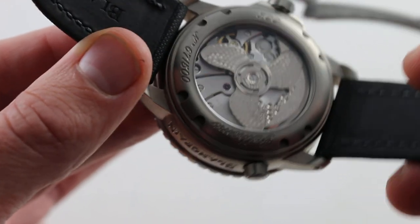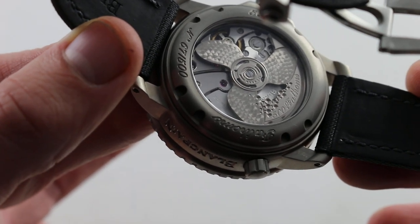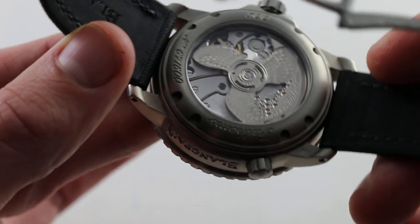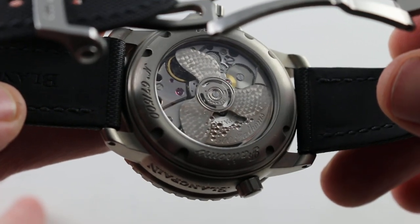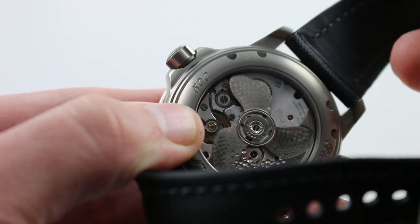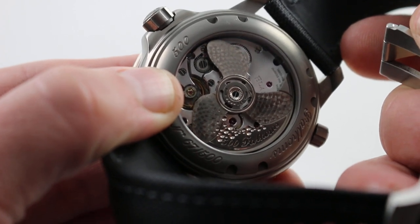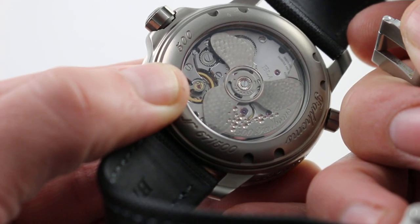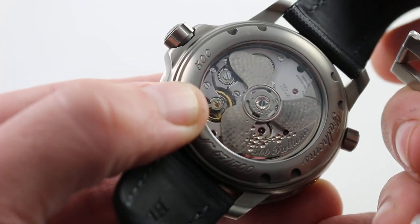It's better to get it started and let the automatic winding take over. The caseback is spectacular, with a nautical propeller featuring gorgeous engine-turned guilloché as well as a drilled engraving of bubbles or cavitations along the flank of the propeller. This is Blancpain's caliber 5215, based on the 1315 and thus based on the 13RO. You will not see this level of finish on a tool watch movement under almost any other circumstances — mirrored anglage that is absolutely beautiful and looks like it belongs on a Vacheron. There's a unique striation brushing to the bridge plates, but make no mistake, the finishing is exquisite, including the jewel sinks with mirrored polish. The screw heads are polished and their slots chamfered.